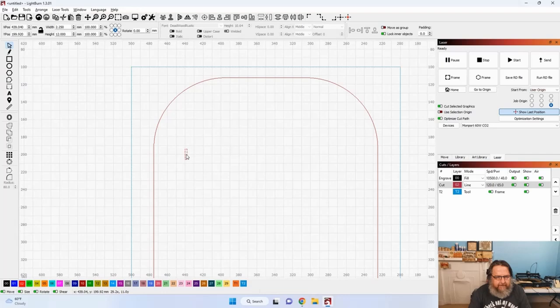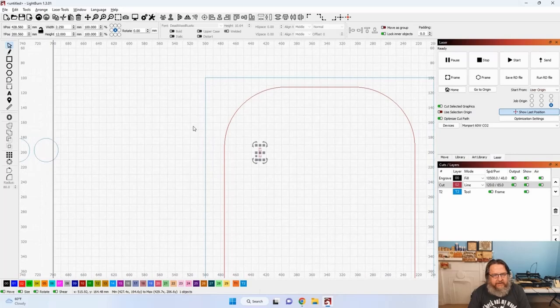This is going to be a slot that I'm going to cut, and I'm going to insert a hook in here that's going to be made from the same material. It's only 2.25 millimeters, and I'm making this cut 2.25 millimeters because the kerf of my laser is going to cut off enough material from this slot that when I cut out my hook, it's going to fit in there, so I can actually cut it to the thickness of the material. All right, 2.25 and 12 millimeters.